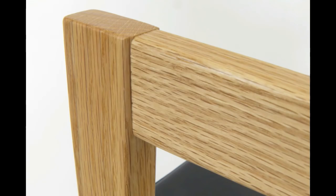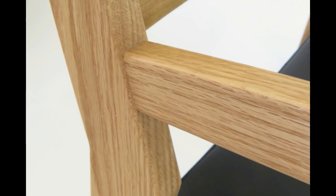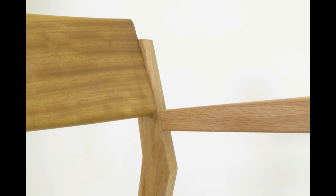So the fine details in these chairs are largely a result of the manufacture process. I didn't want to have any flush joinery where two pieces join together flush because that's have to be a lot more accurate and takes time to clean up those surfaces. Whereas if you can hide any of the inconsistencies in the joinery behind a quirk, it makes life a lot easier, and you don't have to worry so much about when you're cutting the mortises. Plus the sliding dovetail aspect is actually very simple once the jigging is set up. And of course that's something that a particular tool that I have, and I'm making use of it. I wouldn't necessarily think lots of people would have that particular setup, but I'm just using what I have.